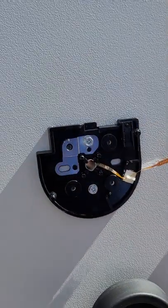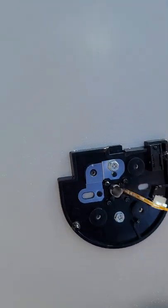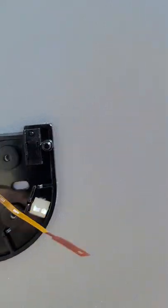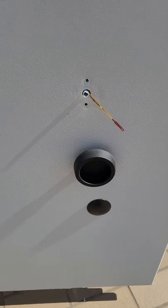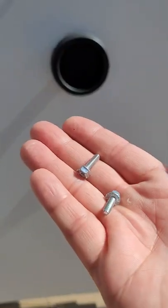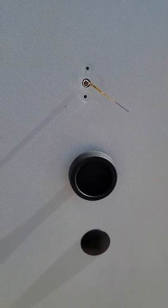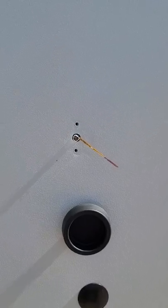That's why you need to remove this cover first, so you can remove this cable. At this point you can remove this plate — two screws, one, two. I went ahead and removed those two screws to remove this plate right here and just pull it out. These are the screws I usually reuse to put the block from the old machine, or you can use the screws from the old machine.